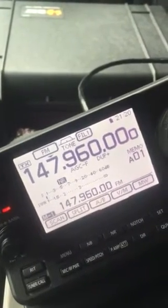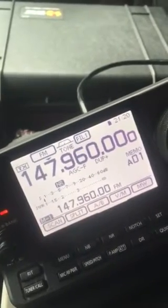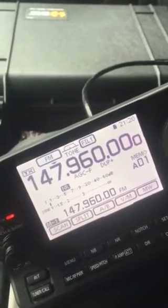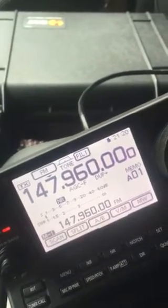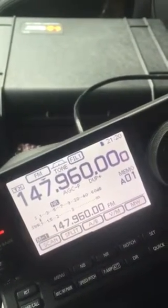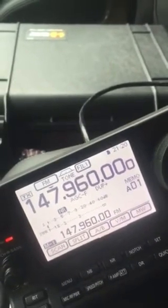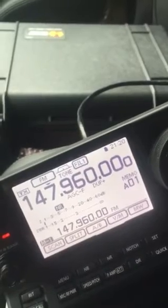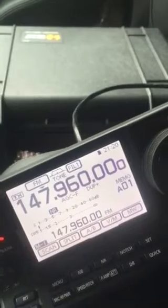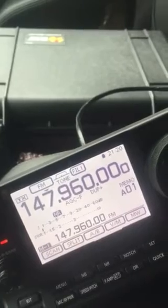I'd love to know that. As soon as this video is done I'll reach out to you. What I'm doing here for the video demonstration is: I have the front panel for the Icom IC-7100 here in my truck, plugged into a RemoteRig 1258 Mark II that's tethered via Wi-Fi to my phone, and the base unit for this radio is actually a few miles away at home. I'm able to control the radio on six meters, HF, two meters, 440, and all that — over the Wi-Fi tether.